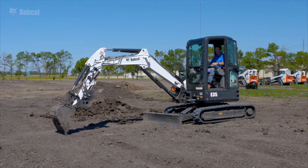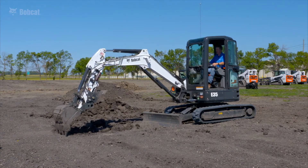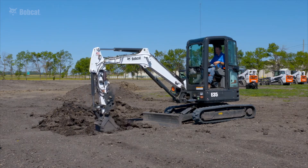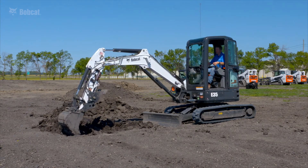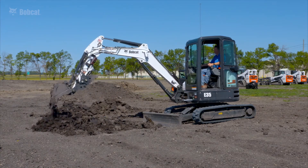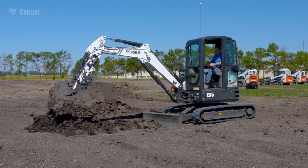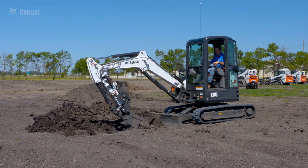I will dig with a gentle peeling off the surface so that I don't jar or move the machine, as that throws the system off. I am starting to hear my warning zone, which tells me I'm approaching my 16 inches of depth relative to base grade. So I'm going to dig a little slower, continuing to strip carefully, not to exceed my depth. I briefly hit target there — you can hear it.